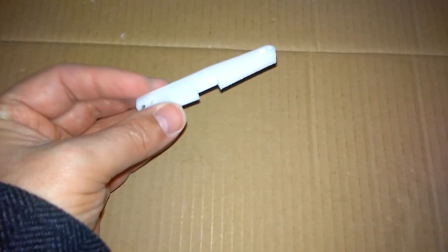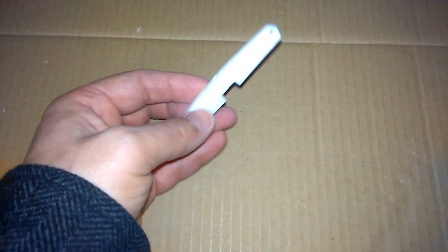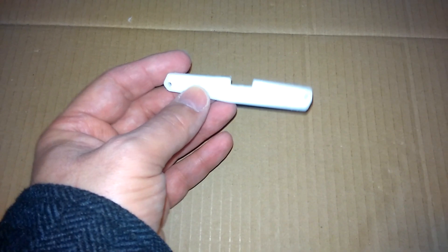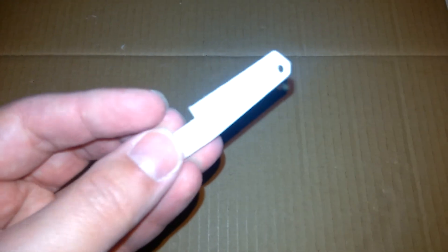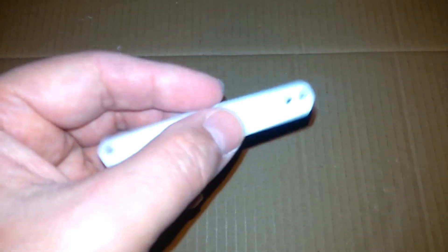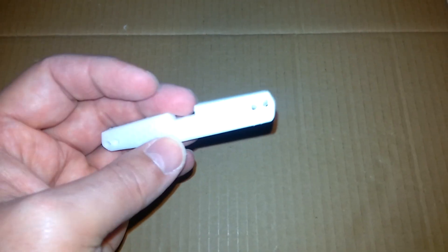The left rob cable back is just a cable guide for the servos at the rear of the forearm. Again just giving it a quick sand down. I have run through all the holes - there's two in each end and they run through at angles. I ran a 3mm drill through there just to clear out some of the plastic that's inside the holes.